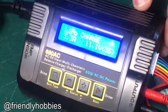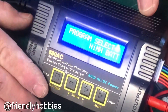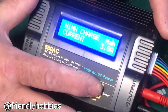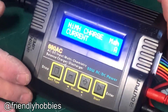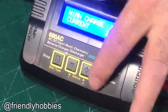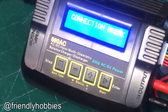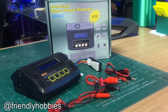To charge a nickel metal hydride, go to your battery type and scroll through — there's LiPo, nickel metal hydride. Press start to enter it. If you want to change any values, press start and you can change the amperage. Nickel metal hydrides are very simple to charge. Press start to lock it in, hook up your battery, and press and hold start. There's no connection here in this demo but it would have charged. Press stop if it goes into an error.